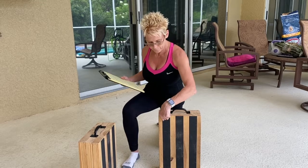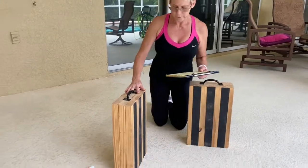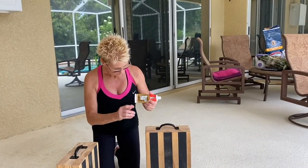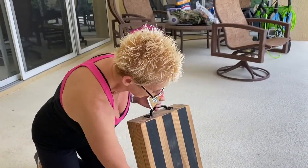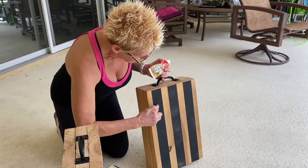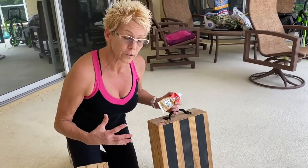There's three for one box and three for the other, so these are going to be cut into eighteen-inch long pieces. You're going to put some carpenter glue or liquid nail between — you're going to work with two pieces of wood at a time. Put the liquid nail or carpenter glue in the center between the two pieces of wood, and along the edges — but leave a space, because when you push the boxes together, the liquid nail is going to expand.